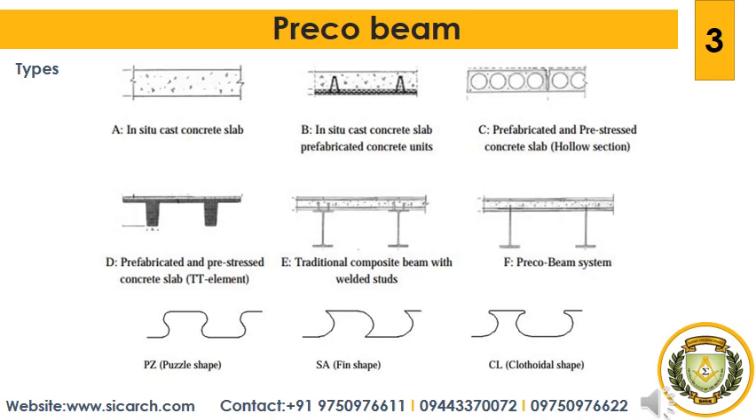As determined by the design configuration using steel profiles without an upper chord, the steel in the span is loaded in tension. In the column and framework corner region, there is sufficient material available to accommodate the compressive forces without the introduction of additional plates into the concrete. With the separation technology used, it is possible to achieve high quality for the separating phases with minimum local notch effects, ensuring favorable fatigue characteristics of the composite system that have been substantiated by tests, so that in the future concrete dowel technology could also be used for structures under cyclic loads.